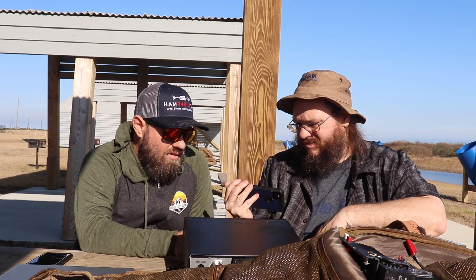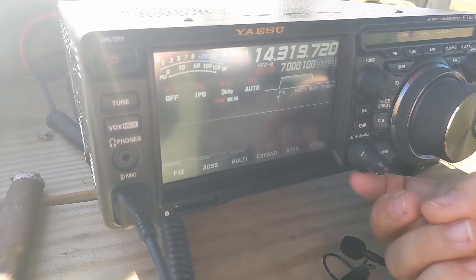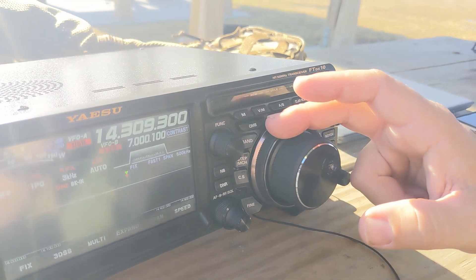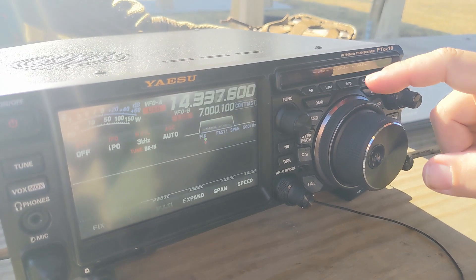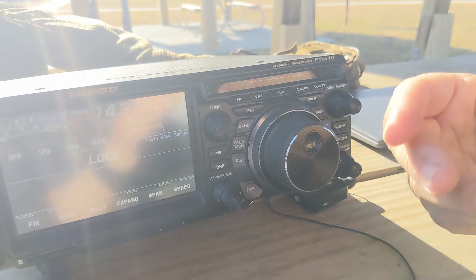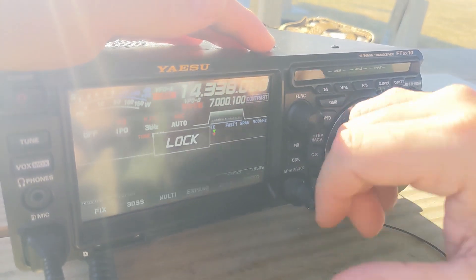This is your digital noise reduction. There's a whole algorithm that John Crook from Yaesu explains on my channel about how it works — just think of it as a way to eliminate noise and pull in weak signals. AF is your volume, and RF/squelch is your RF gain and squelch right there. This is your tuning knob, and this is your fast tuning knob — you can tune really fast with the larger knob. The lock button: once you find a frequency, hit it. Now you're calling CQ POTA and won't knock yourself off frequency accidentally — that happened to me on my first activation.